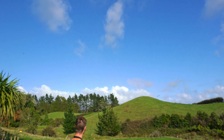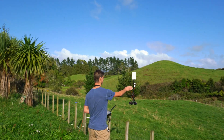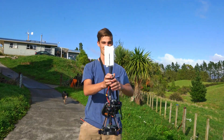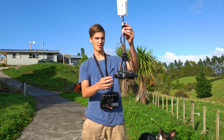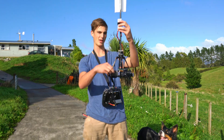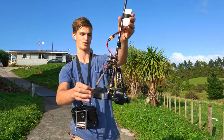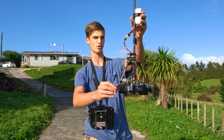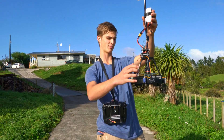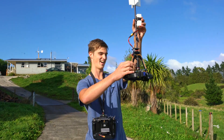It actually got way out of shape on the way up. These fins work great when it's hovering, but as soon as it's not hovering it went crazy. Inside iNav there's a setting called TPA — Throttle PID Attenuation. Basically what that means is you can see the response is quite severe when I move the aircraft, but it will decrease that response based on how much throttle I'm using. For the next few flights I'm going to change that TPA, but for now I'm just going to see if we can do another free fall.